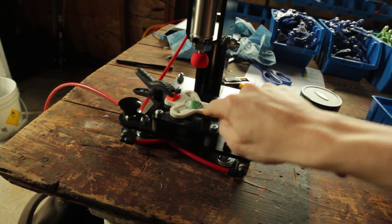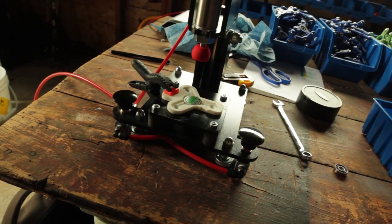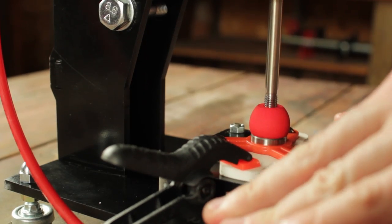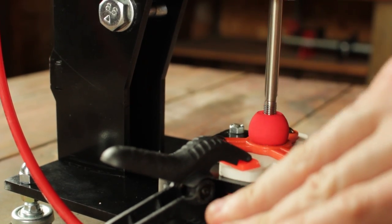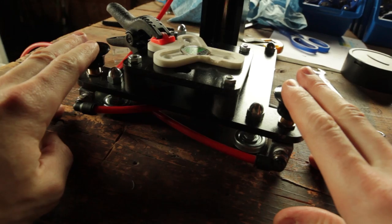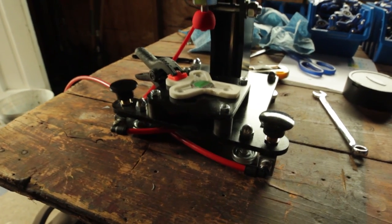I also made a little relief here so that when bearings get stuck, I can get them out without hurting my nails — just a small thing. It does seem to take on average around two punches to get the bearing in, because there's a crease from the parting line when the part is made in the plastic injection mold — it's a little bit smaller in diameter there. I also put two buttons so that I can't crush my hand in the system. Isn't that a sweet sound?